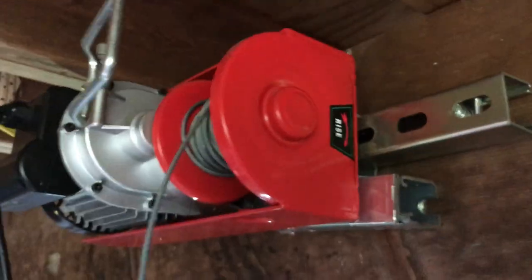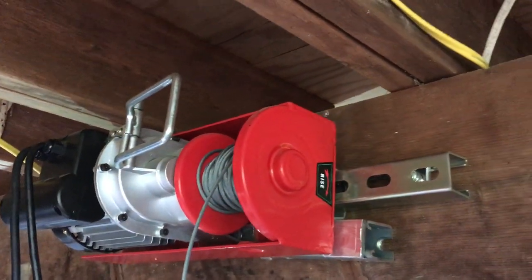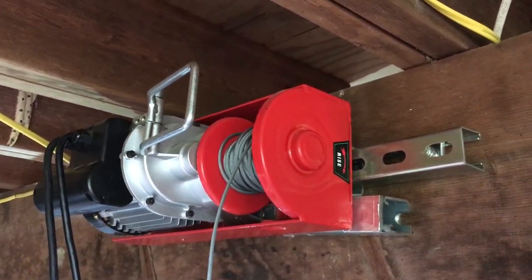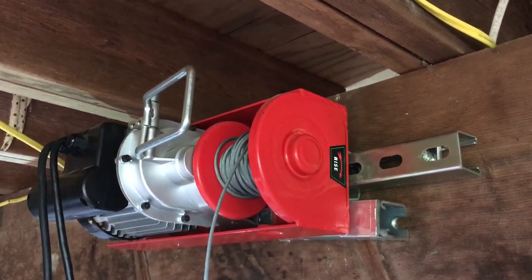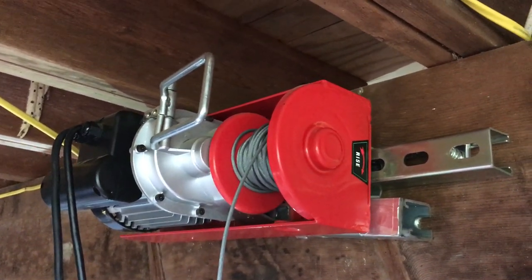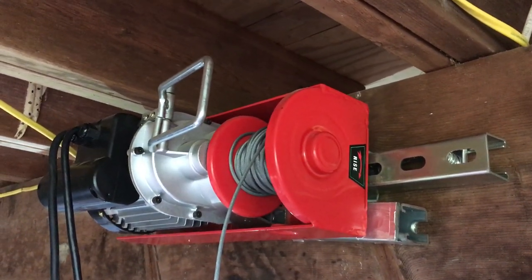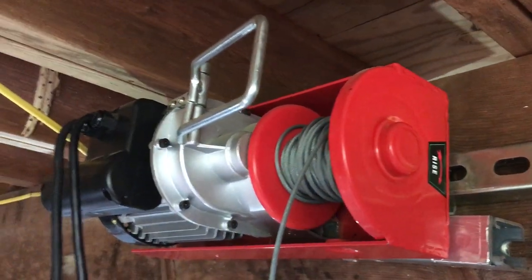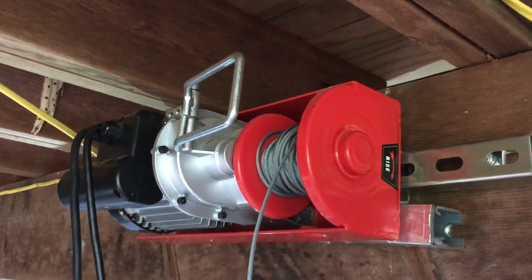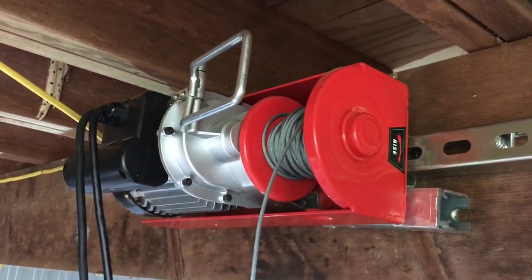The big deal is I schlepped this thing up here and got those rods lined up and popped them in. A little tip: I used an installer's bit to drill the pilot hole, using a square to make sure I was going straight through. Then I used a larger bit to over-drill the holes to make them half-inch. I don't have a half-inch ship auger, but I don't need one yet.